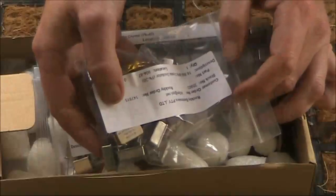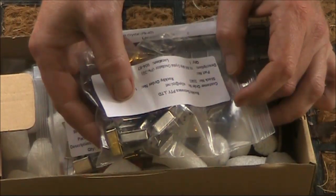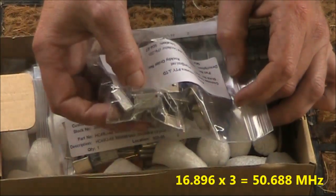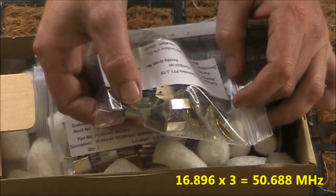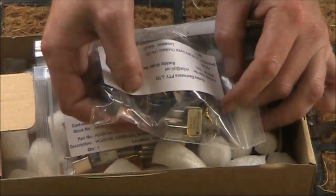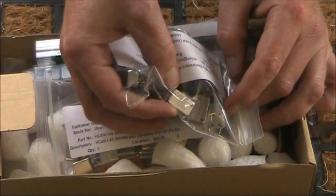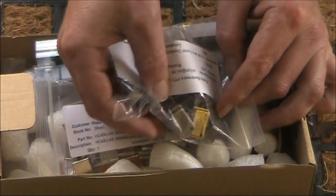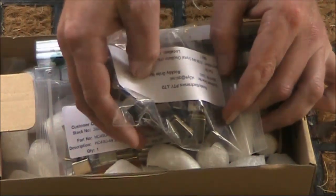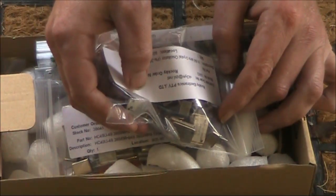Next, we have a 16.896 MHz crystal oscillator. What are you going to do with that? If you put a tuned circuit on it that's resonant at three times that frequency, you get to just below 51 MHz. That's out of band in Europe, but in North America and in Australia that's still within the 6m band. So if you wanted to build a simple transmitter where you're certainly not going to be interfered with by other 6m activity, then something like this could be useful. And there's 20 of them, available very cheaply. How could I resist?